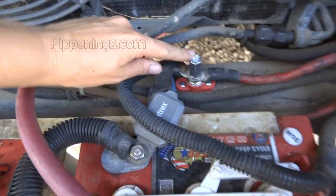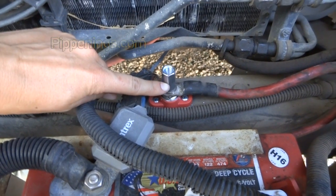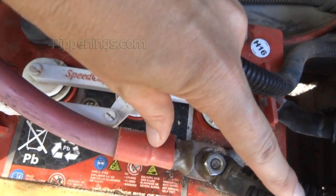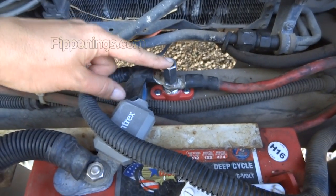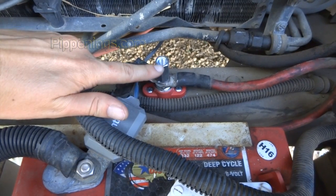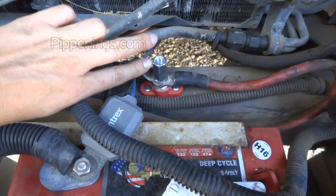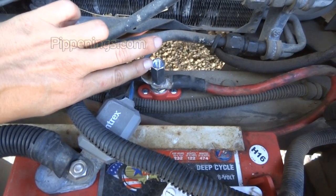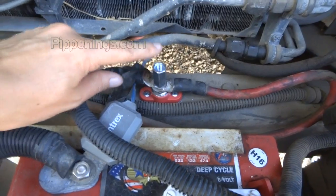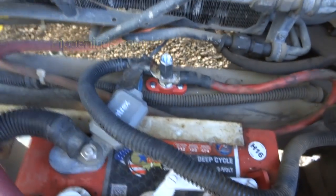I'm going to need, see, I got this is called a nut coupler. So there's a post under here and it wasn't tall enough for these two extra cables to attach to. So I removed two, so I had enough post to put the nut on there. Now I've got some empty space in the nut. I'm going to cut the head off of a bolt, put that in, so then I've got a new length of post that these guys can attach to when I'm ready.